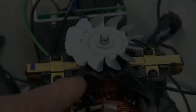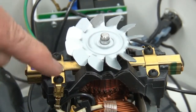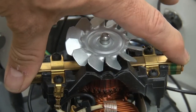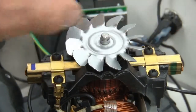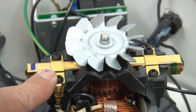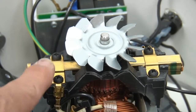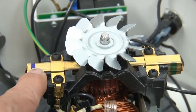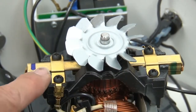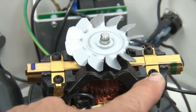Order a set of brushes. Your motor has two brushes — make sure that you only take out one at a time and install it. Don't take both of the brushes out and then turn around and put both back in, because you want to have one in place so you can compare it. When I change this brush, I can look and see if this one is the same length as this one. If I don't have it exactly the same, then I know I need to adjust it — I didn't put it in properly. So use one as a standard, then change the other brush.